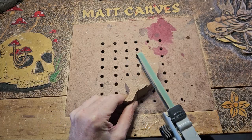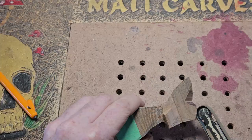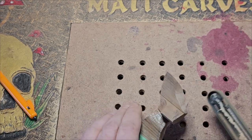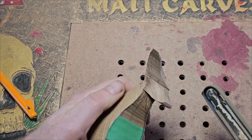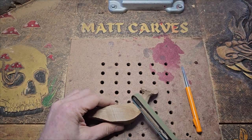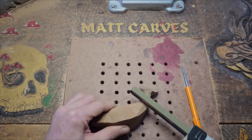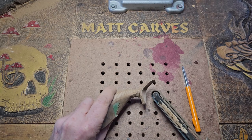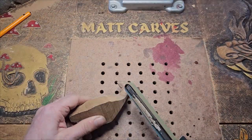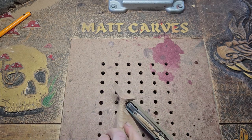You're going to have to look at part two to kind of understand what I'm doing, but first of all we'll get on with carving this whale. I've kind of cut out the main shape on the bandsaw and I'm actually going to use the finger sander for rounding it off. I've found it pretty useful — there are two reasons: when you carve hardwoods and you're using a burr you're pretty likely to burn the wood, and the sander is taking off the wood quite quickly as opposed to even your Kutzall flame burr.